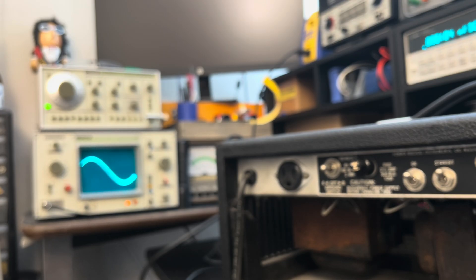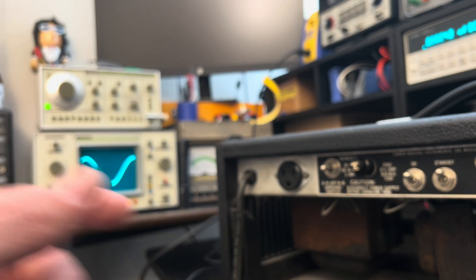You do have a hum balance circuit — super cool. I love hum balance circuits. These pots tend to short out in short order, though they don't appear to be doing that now. They're not specced out to the appropriate wattage or heat dissipation for the task — this thing is handling some current, so normally you'd want like a 2- or 3-watt pot to do this job. Some guys will replace this with a 100-ohm resistor to ground, but I much prefer having some adjustability there to dial it out, because the windings are never truly balanced from the factory coming out of the transformer.